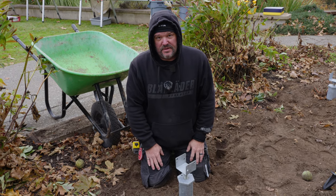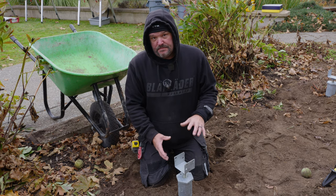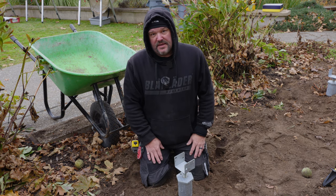These piles are all six feet deep in the ground and they all hit pressure, so the odds of this moving are pretty low even in an earthquake situation. Eventually something might dip, but you can always come back, pull that set screw, and adjust this if you can get underneath the deck. That is how I justified elevation on this particular project. There are several different ways to do this — this may be a more advanced technique but it saves hours over traditional methods. Search our channel for titles like 'how to justify grade' and you might find our videos helpful. Thanks for watching — please click that subscribe button, hit the bell icon, like this video and leave a comment below. Let me know what you think of my methods. Have a great day!